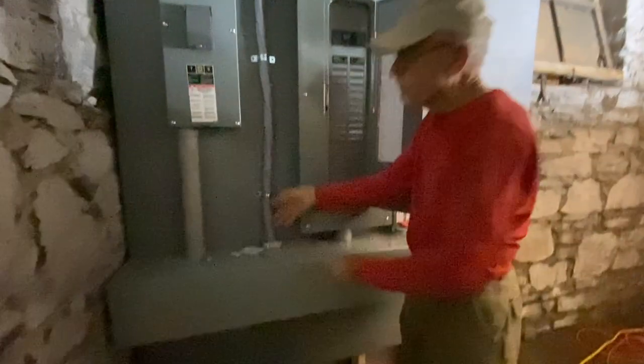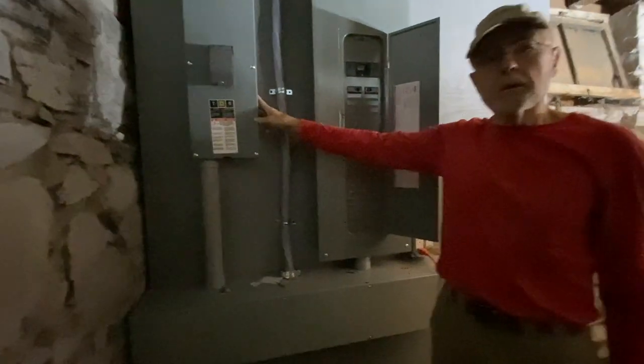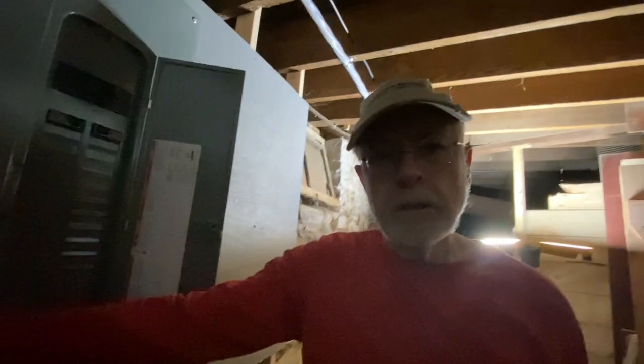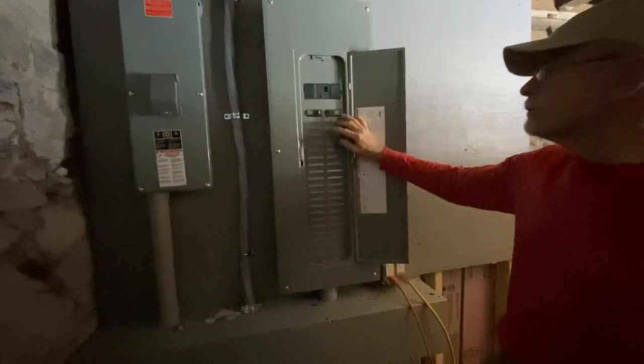Another line comes out and goes to the panel here in the basement — this sub-panel has only two circuits on it, two 20-amp circuits. Those serve just these two plug-ins right here, each on a separate circuit. One has the light and one is where we're going to plug in our electric car. We have two panels to split the electrical load in the house so there's room for circuit breakers for everything.